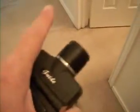The grout is leaking and we've got water penetrating the carpet down here in the guest bathroom, and we have water that's coming out under the carpet in this area here. You'll see the infrared photograph very clearly showing water penetration.